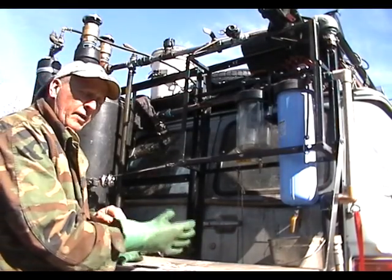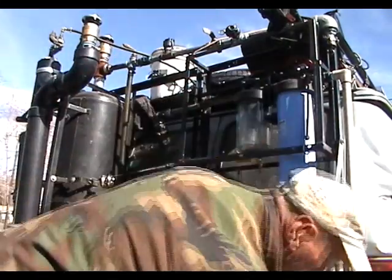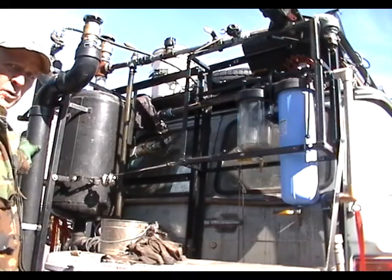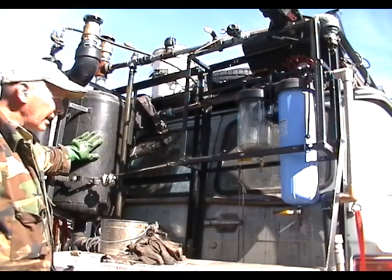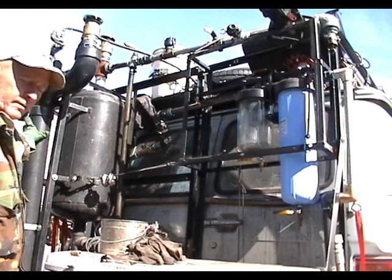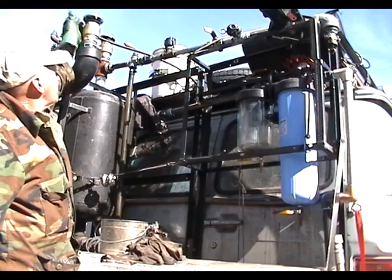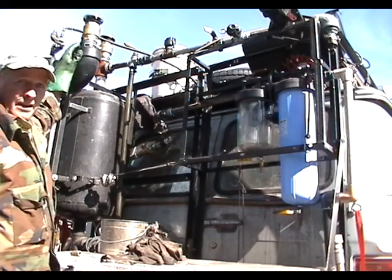Okay, now that we've finished draining all the traps and filters, we can now backflush the system. The process of backflushing the filters involves using this device here, which is a copy of the big 20-gallon or 80-liter processing tank, but this only holds 4 gallons or 16 liters of gasoline. I have a vented fuel cap at the top, which I remove and just put the filler nozzle from the gas station right into this.